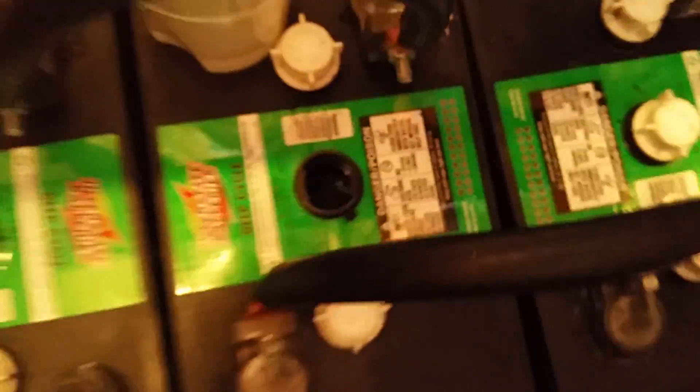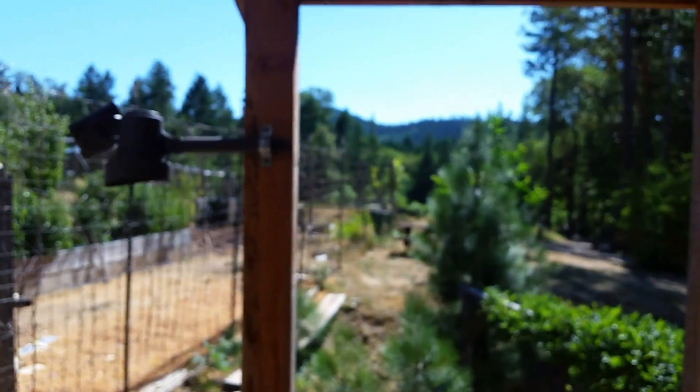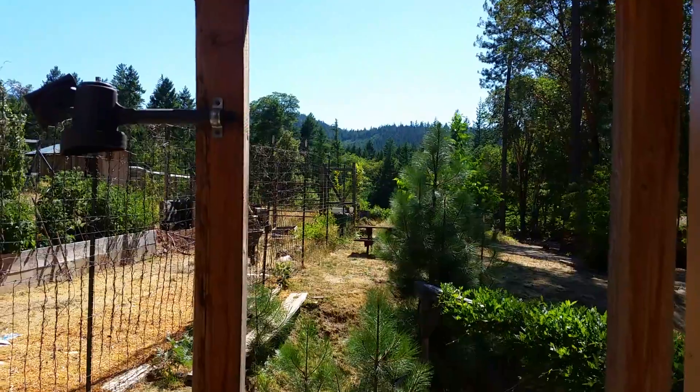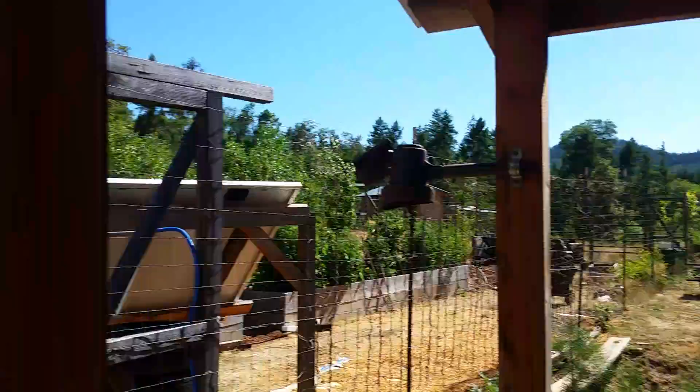And I noticed today — the reason why I'm making this video — is that 3 and a half years off-grid and have plates look that clean, I think that's remarkable. And a lot of it is because I don't cycle the batteries. Typically we use the top 11%, but we've been actually taking them down to 84%, so 16% of the battery. We don't go lower than that, never have. And that's why the plates look new — the batteries haven't done very much work at all.